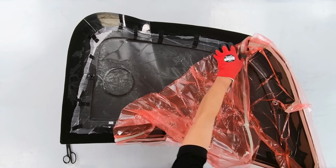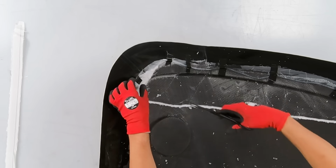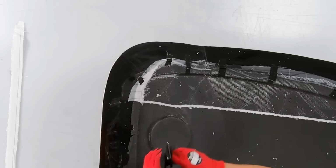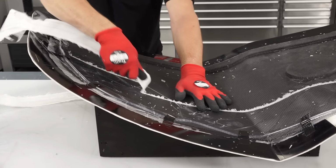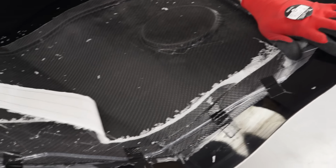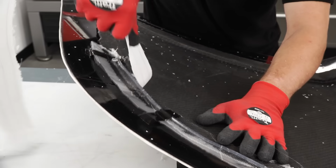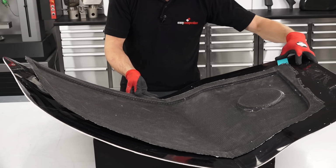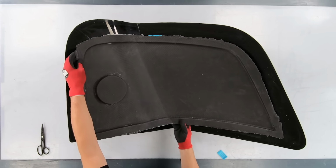The vacuum bag can now be torn away and then the peel ply and mesh removed. The easiest way to do this is to snip the peel ply at 100mm intervals and tear it back in strips. You will need safety glasses and gloves for this, as the cracked resin forms some pretty sharp splinters. The peel ply removal has already started to release the part, so with some gentle prying, it pops out with ease.